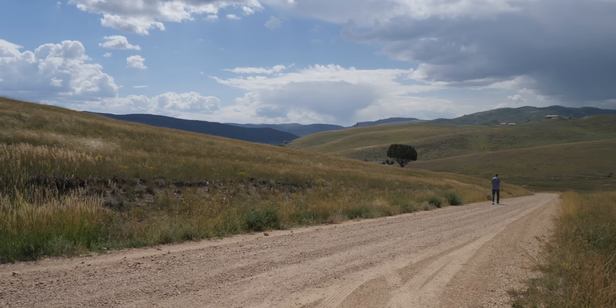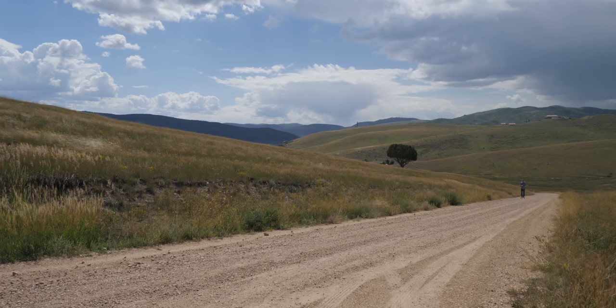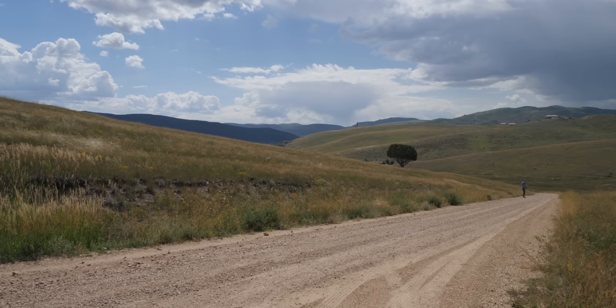Now, if it's in direct line of sight, even outdoors like that, we were able to get up to 100 meters and get a pretty good solid connection. So if you are going to be working outdoors, I would recommend that you put the transmitter on the front of the person facing the camera so that there are no obstructions there and you have a better chance of holding on to the signal.